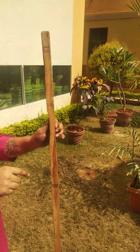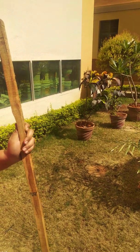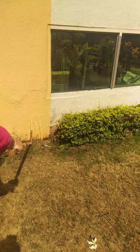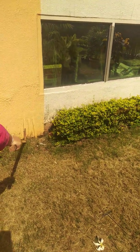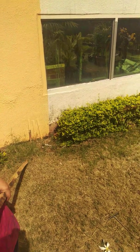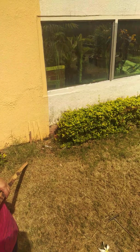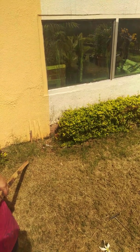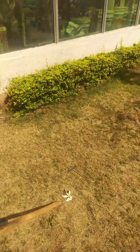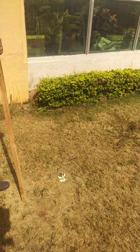These measurements vary depending on the requirement of the experiment or the question paper given in the lab. From the earth electrode, this will always be the reference point. Given the value of capital D, which is the total distance between earth electrode and current electrode, and small d, which is the spacing of the potential electrode P — by knowing these two values, we will start to conduct this experiment.